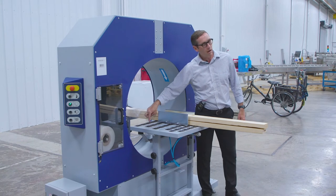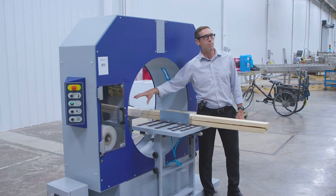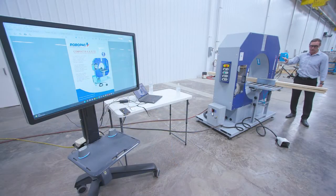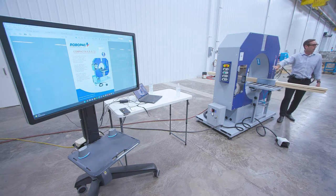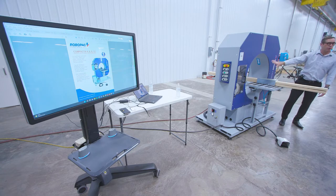This autofilm cutoff runs on air, so it's going to run at six bar or 1.3 CFM. When you're sizing these machines, send me pictures of the product mix if there are any concerns. All you need to ask for these machines is what's the min-max diameter. That's it — you just have to get it through this ring.